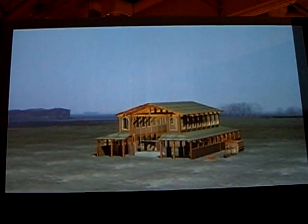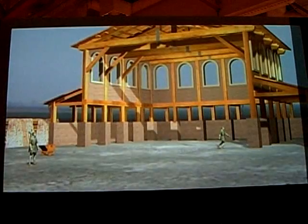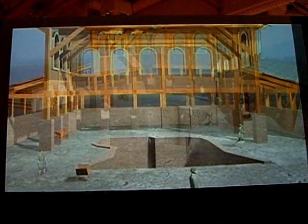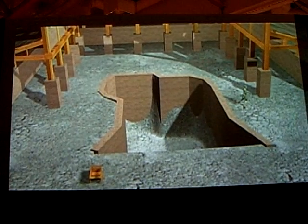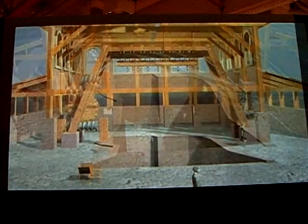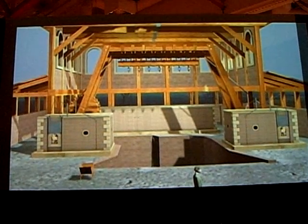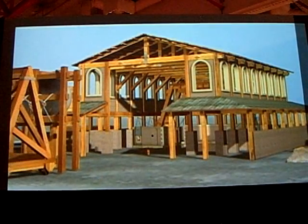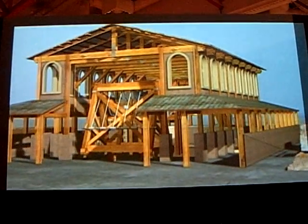Contemporaneously with the molding operations, the work site is prepared. The casting pit is dug and a supporting structure and masonry is built inside it. In the furnaces, placed around the edge of the pit, preparation of the bronze begins. The clay and wax is removed from the molds, after which they are transported along with the core to the smelting system on trolleys actuated by powerful winches.